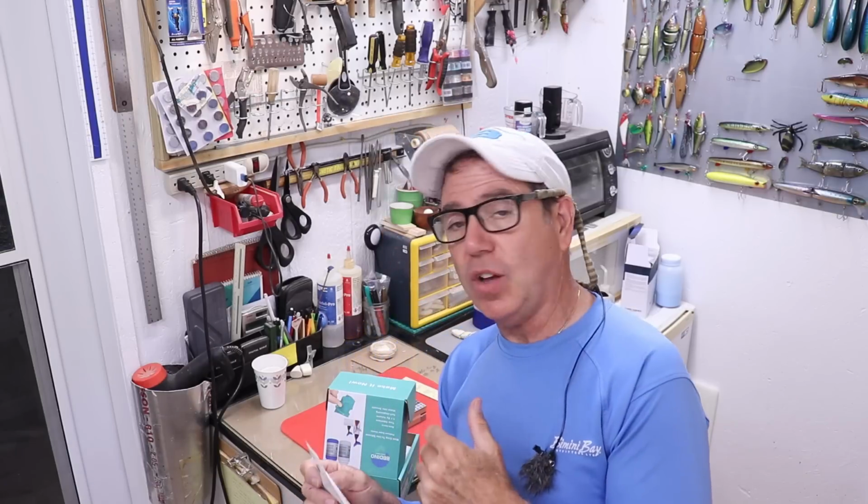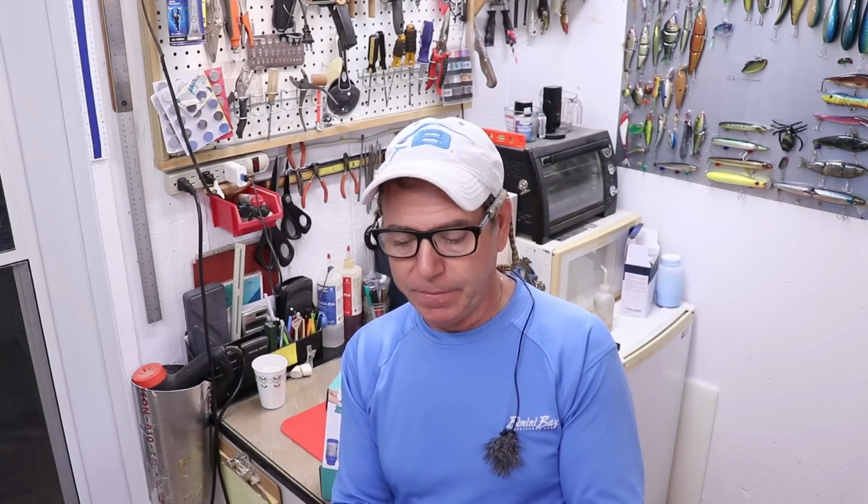I get a lot of folks asking me for a little bit of help because they're having problems with their silicone setting up correctly. And if you're using platinum cure silicone, this is probably why. And this one actually comes with a nice little list of things not to use with your platinum cure silicone. So number 1, you can't have clay that has sulfur in it, so it has to be sulfur-free clay. You can't have it come in contact with tin.